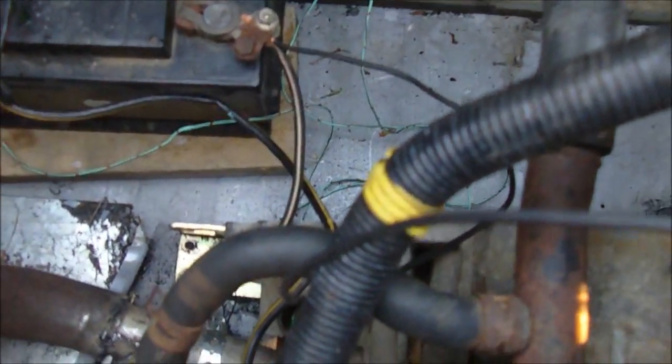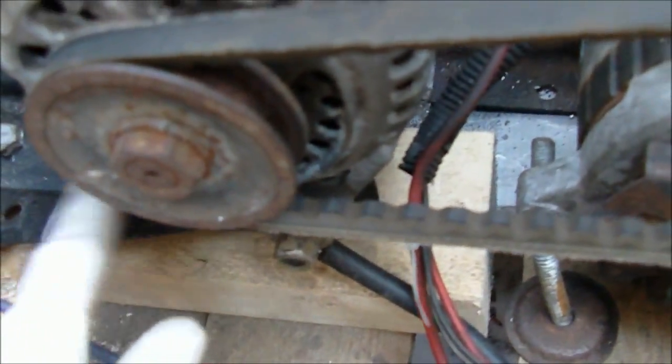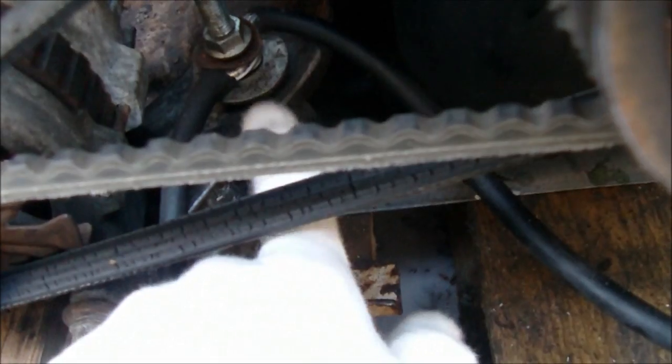I'll just show you how I've mounted everything in here. The engine is just mounted down to the skid and I have a few brackets at the back of the engine here, and a bracket over here as well — just old actual bed frame — and on the side here is basically one of the main brackets that bolt into the side of the engine. These are just random brackets off of cars, and this one here I've just cut the original mount off the car and bolted it directly down into the skid.